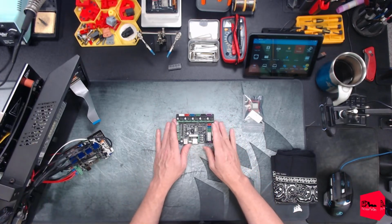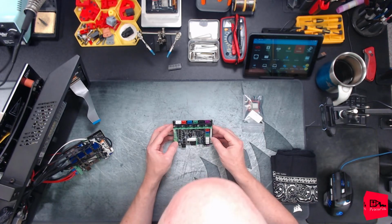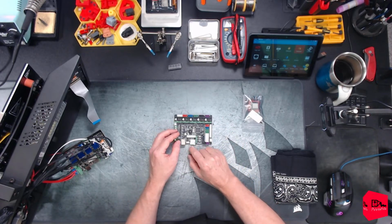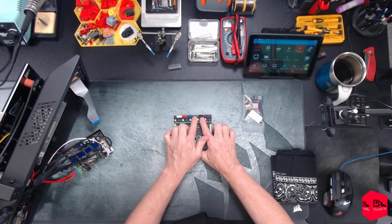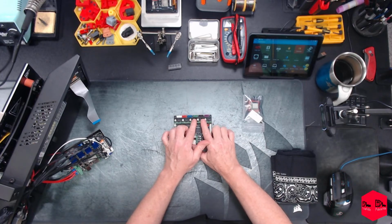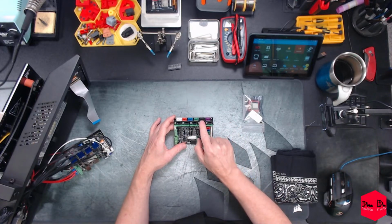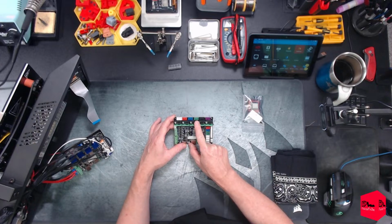So what that tells me is, since we don't have a double connector on this board, I have two options. One was I could get another driver, install it first Z, second Z, but then I'm going to have to do some changes in the firmware. The other option is I believe I still have some motor splitter cables.